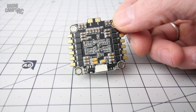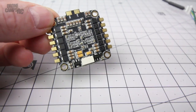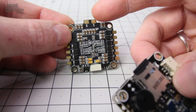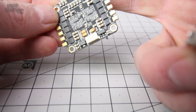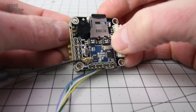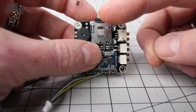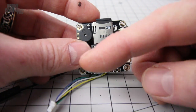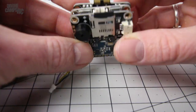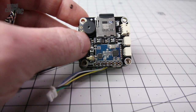The numbers on here are listed as wrong, so looking from the forward direction with battery terminals facing forward: what I'll probably do is run a wire underneath the whole stack with my battery XT60 coming out the back. Stacking it up and looking from the front - motor one is physically correct down here, motor two up here, three and four corresponding to your tabs. That's how it sets up in Cleanflight or Betaflight, so I'm going to run my wires underneath to make setup a little easier.